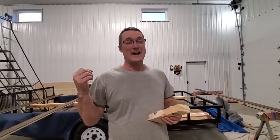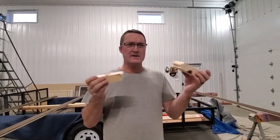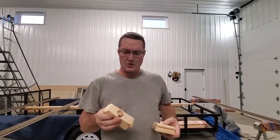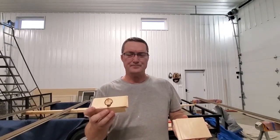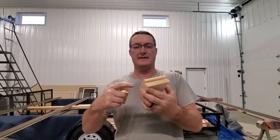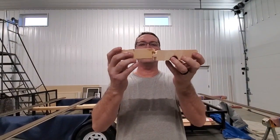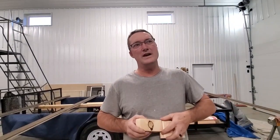All right, we're down to the last two pieces. The problem you get into with tongue and groove is you're up against the wall. You've got the boards and you've got a wall, and you can't set your board and then slide it in. Normally that's how you would end up having to put them together. So on a normal floor, on the groove side, you would cut off the bottom, and then whenever you put the last one in, it just goes in like that.